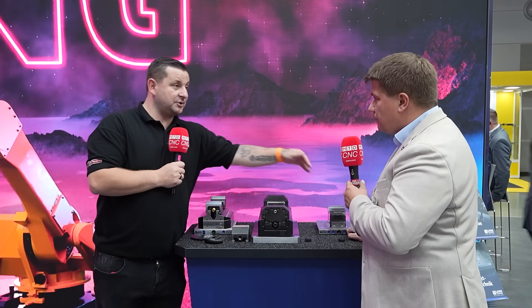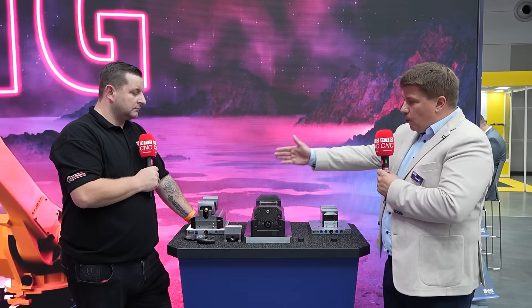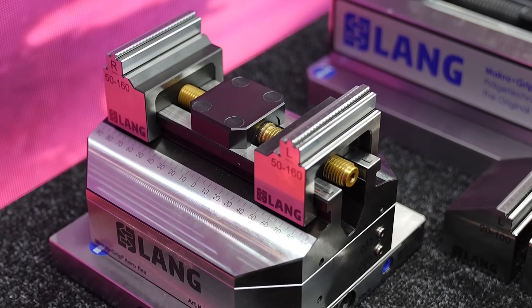So what's the difference between the vice on my side and the vice on your side of the table? Basically the flexibility. On my side you can see a classical pneumatic vice — if you want to change the clamping range here you have to move the jaws manually, so it's usually a vice for bigger batches where you don't have to change the clamping range that often. On your side, the flexible vice — the macro flex vice — the clamping range can be adjusted by the robot. That's to say you can clamp five parts at 100 millimeters, then five other parts at 80 millimeters, fully automatically by the robot.